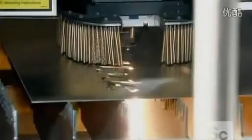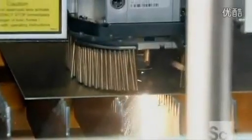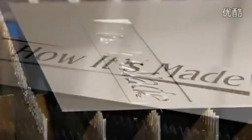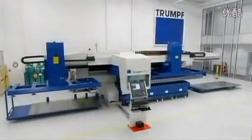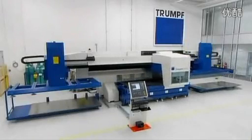The motion unit moves in three axes, enabling the laser beam to cut different thicknesses in two dimensions. A stamping machine leaves rough edges that workers must grind smooth afterward, but a laser cutter leaves a smooth edge that needs no further work. This saves on time and labor cost, making this technology a cut above.